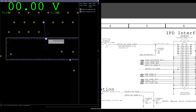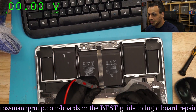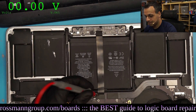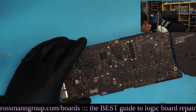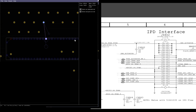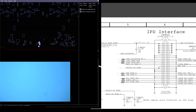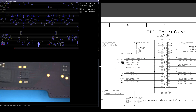Now we need to check for PP5V S4 trackpad F, and that's on the other side of the board over here. The problem with trying to measure that — it's over here on the other side. So I've got to take the board out in order to tell. We need to see if we are getting 5 volts on this MacBook on pin 25. That's going to be on the other side of the board.